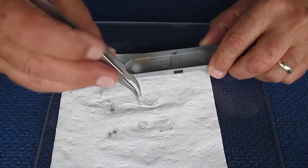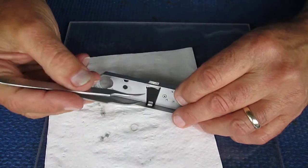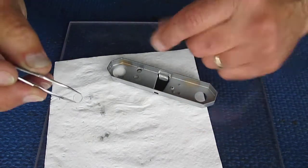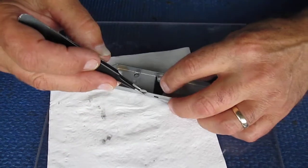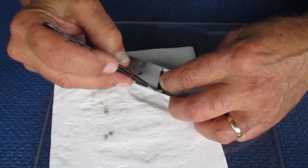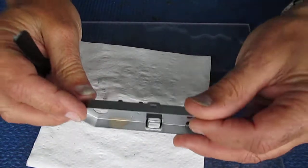Assembling this is always a bit entertaining. We start with our front piece of glass, drop that retainer in place. And now we have to get the rear piece of glass down into place where it's held. As I said, that was flat on one side and vaguely convex on the other — the convex side is inwards, the flat side is towards the back of the camera. We have to get this into place, and it is always awkward. So I'm pulling that black piece as far forward as I can, just pulling that tab slightly forward so I can slide that glass down in there — and there it is, sitting in position.